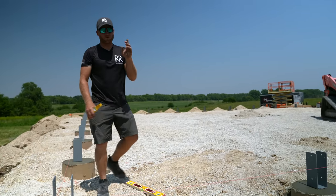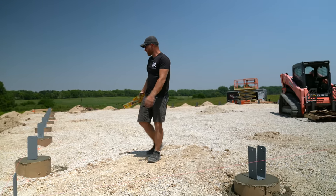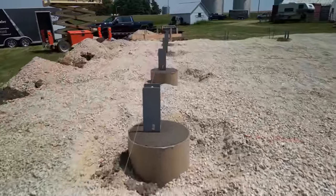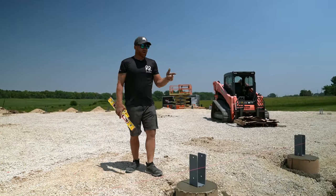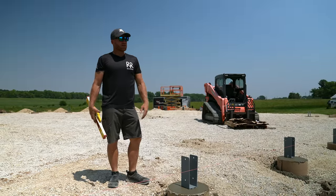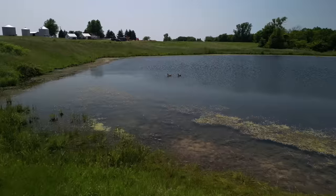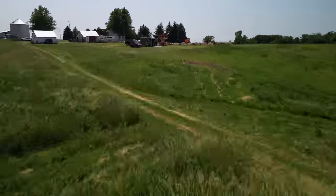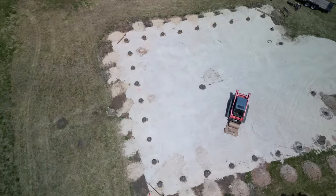That's the last bracket. The second pour was infinitely more comfortable - maybe less stress. You get through the first one, everything goes good, you feel confident. We got all these brackets set. Now what we're going to do is let them set up overnight. Tomorrow we're going to come back, get all of our elevation marks on each bracket, cut posts, and start building walls. That's going to be a new video, guys. I hope you enjoy this series - we're going to be back to building a farm shop. The thing a lot of you guys followed this channel from the beginning on. Make sure you subscribe, follow along, drop me a comment below if you learned anything in this episode. Concrete day is always stressful, so I'm going to go home, relax, and we'll be back tomorrow with more work.